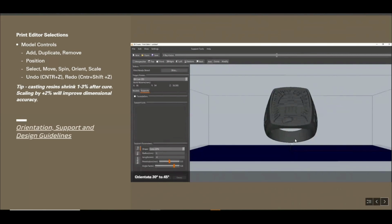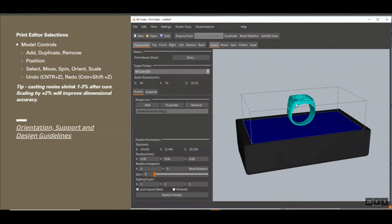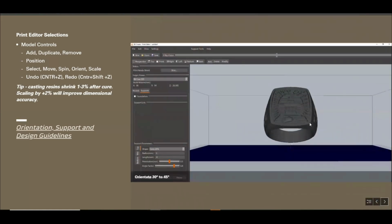Well, if you do, and just for your information, the way the printer works is it prints a layer at a time. So if I had this orientated vertically, like in this picture, when it gets up to this top section, every layer sticks to the DuraVat surface, and the build table, when it rises, pulls it off. So when you're printing large surface areas, it can cause a roughness on the edge. Just because that surface area is so large, when the build table pulls that off, it causes some stress lines on the edge. Some people call them build lines. So if you orientate large surface areas, as I did in this particular case, you're printing less surface area, right? Yep. Each layer is less surface area, and so those types of issues get resolved.